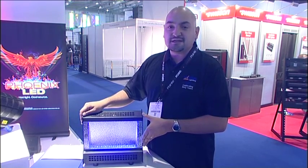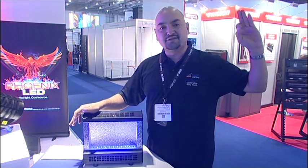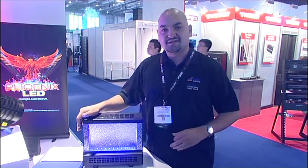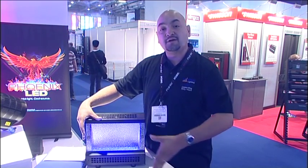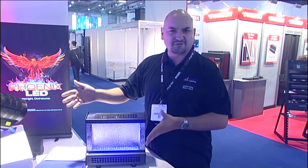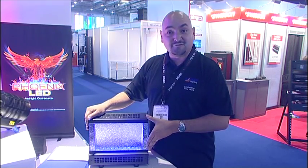It is a bit unique. Typically, to get wide coverage such as this on a wall, you're going to have to get a metal halide UV flood fixture back three, six, nine meters to get full wall coverage. Because of our use of an asymmetrical reflector, the UV LED SpectraCyc can come one meter back and get a full 20 feet — close to five or six meters — vertical. So quite a bit of coverage.